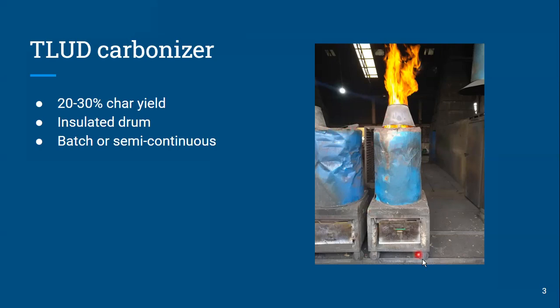It's a nice sequence they've designed. At Khmer Green Charcoal, they've built a lot of infrastructure to allow operators to easily move the kilns around and locate them underneath the drying duct. They actually use the heat to dry briquettes. You can produce a lot of heat, and in most cases — even with drum carbonization — that heat is just wasted. There is provision for capturing it, but it takes some design effort and investment.